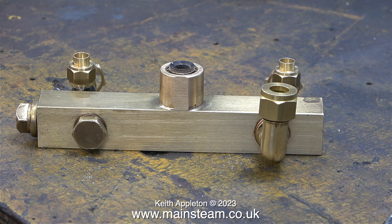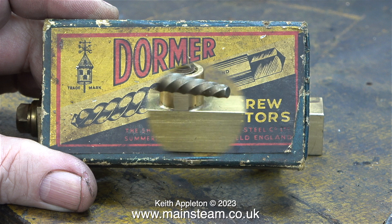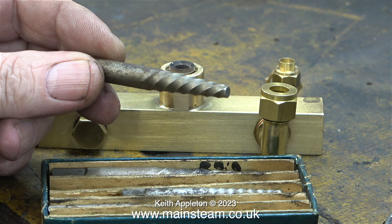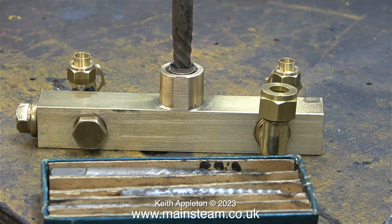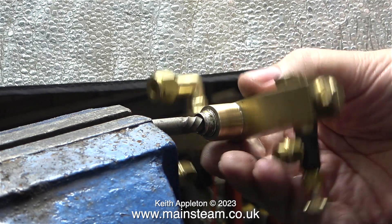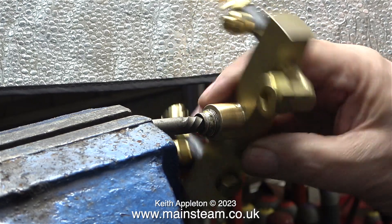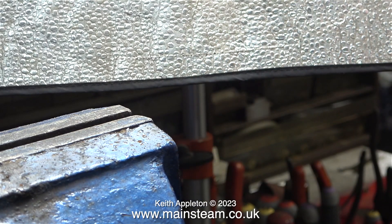I need to remove the threaded part of the valve left in the turret. For that there are specialist tools every workshop should have — this is a very old set of Dormer screw extractors, all 100% perfect. You open the pack, select the size that fits the hole, insert it, and rotate it to remove the stuck thread. The best tool to use is a tap wrench. Personally I find the best method is to clamp the tool in the vice and rotate the part itself.